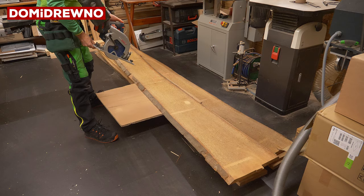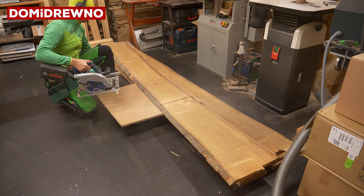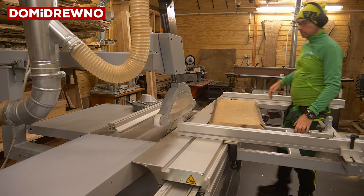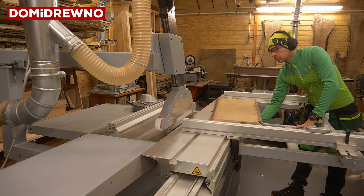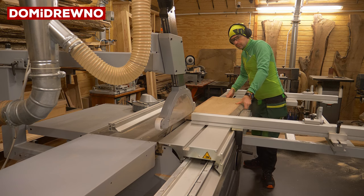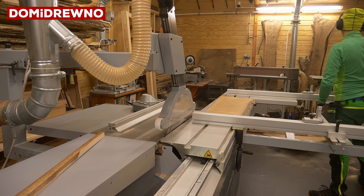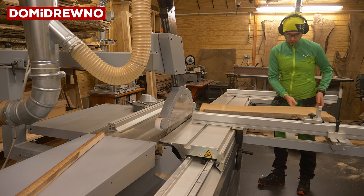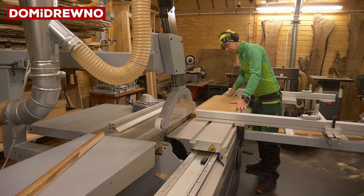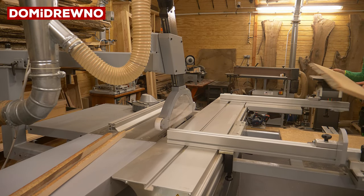I will start on the floor, like you see. I'll do some rough cuts. It's beech boards, about 25 or maybe 28 millimeters. Two cuts and I can jump on the huge table saw. Just for two cuts on the edges. And like you see, the burn marks — I know I'm pretty lazy today. I should change the blade. This blade is not exactly right for cuts like this.